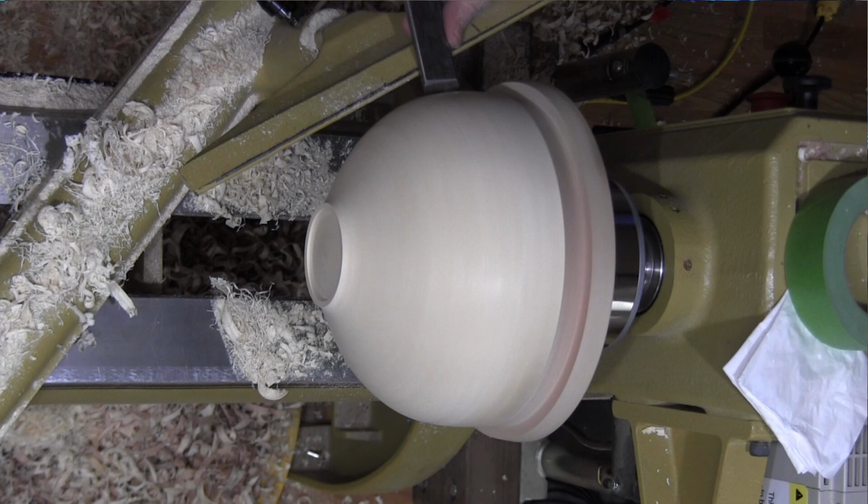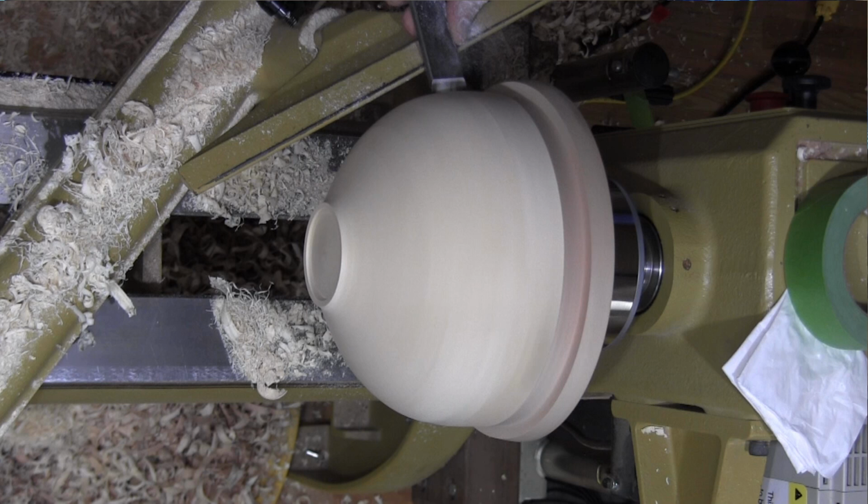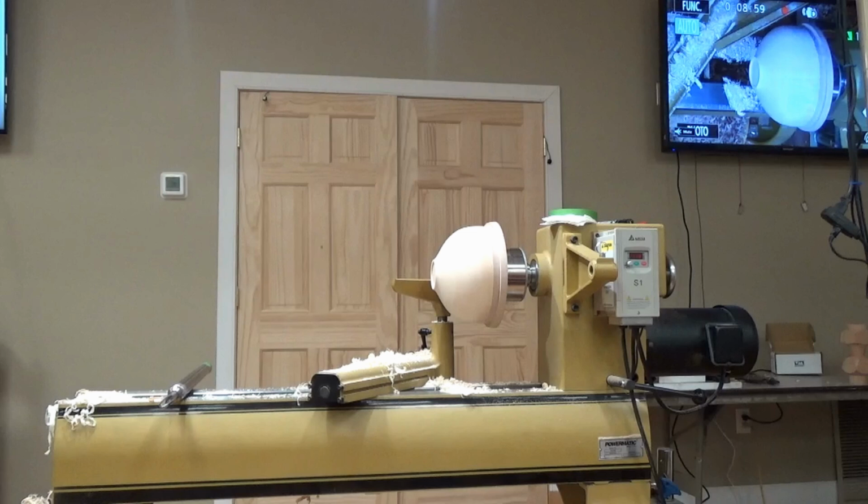But what it's able to do is this magical blend, out of the toolbox better than, like this little flute mark here with my gouge. I can just blend it out there in that little low spot, just like that. When the burr is gone, this is no longer a negative rake scraper, it's just a dull chisel on its side. And so it's almost dull already, so let's put a burr on. Use a coarser wheel.